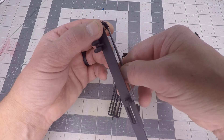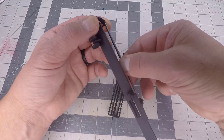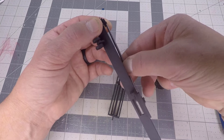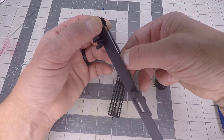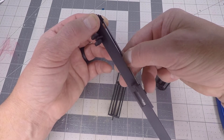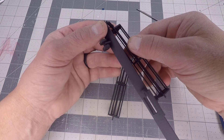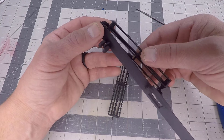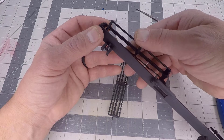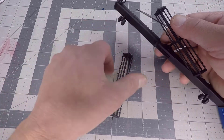Hold it with your finger like I am. Do not press hard, press gently. I do not recommend using a drill bit, as drill bits grab and cut and that could break the arm. We're just going to spin that in reverse, removing some of that material inside. Then we can gently work that back and forth until it's seated. Do not force this piece — if it doesn't go gently, don't force it in.